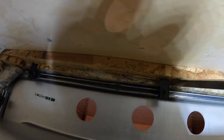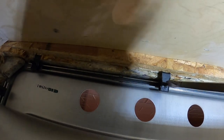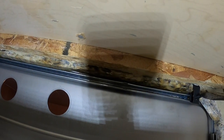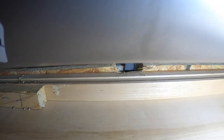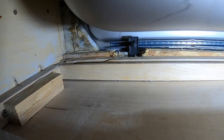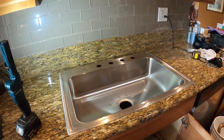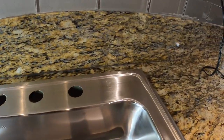I've got that clip in place right there with my Phillips screwdriver, and I'm going to tighten it down equally. I'll go back and forth — hit one, go to another one, go to another one all around, then add another one, and continue to tighten equally on all those clips. Here are the ones in the front that I've cut grooves for — those worked real nicely. I've got all those clips in place and the sink is held down real nicely. We've put some silicone in the back right there — easier to do before the faucet's installed.